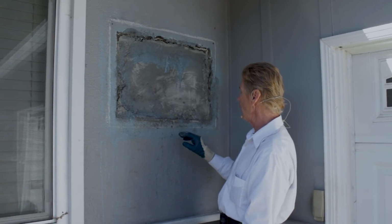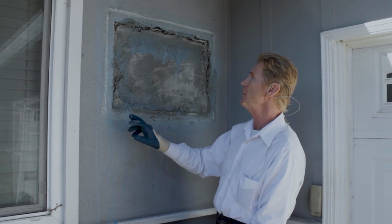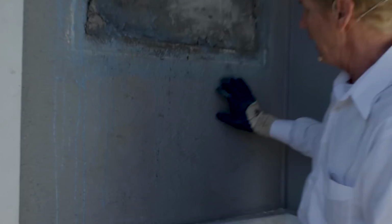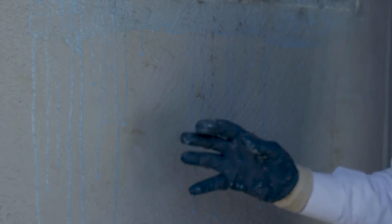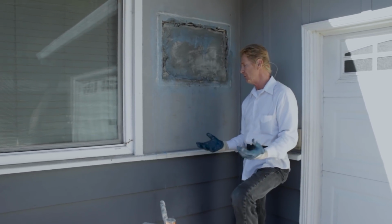Anyhow, this is what he did, and we're going to clean it up a little bit. We're going to plaster it. It'll probably take me 5 minutes to plaster it. This finish here, you see that grain. Now all that is they take a sponge float and they bring out the aggregate. They bring the sand out. Aggregate's a fancy name for sand.